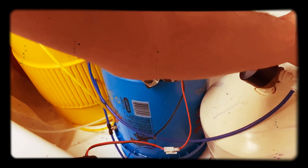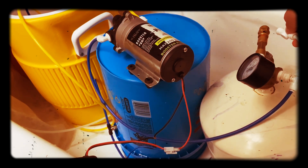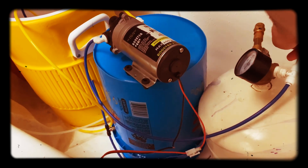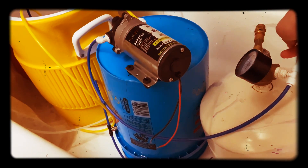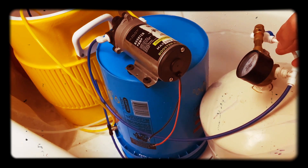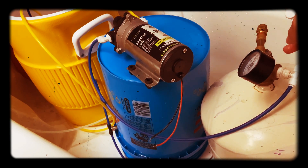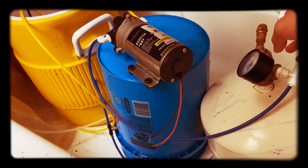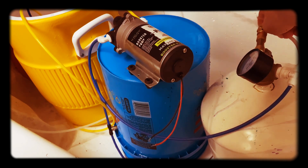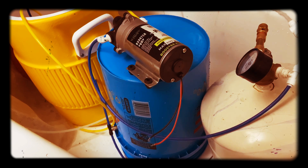Let's see how we did on the pressure here. That's how the accumulator tank works — see all that stored energy in there? That's the stored balloon energy pushing back out right there. If I just unplug it like that, now you can see it's just running. That's the pressure coming out of the bladder tank, see? So that's all free energy — well, it's energy that I already put in there. If you imagine this hooked up to your solenoid, that's what your tank is doing — it's still emptying out whatever was in the tank, coming out at the set PSI that I have it at.